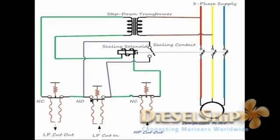However, when you come to this, during normal operation with the same suction pressure, this link remains open because it's a normally open contact. You can see the difference. It is spring loaded and it is open. And when you come to the HP cutout, this is also normal. The excess pressure beyond the normal pressure comes here, and it tries to open here against the spring force. But since the pressure is normal, the spring force is more, and thus this keeps this link closed. Then it goes to the solenoid coil, and now the transformer circuit, the control circuit, is complete.